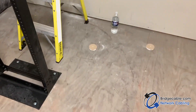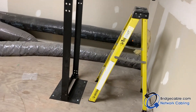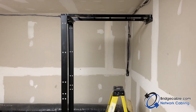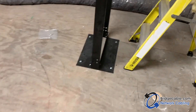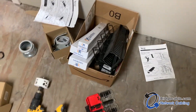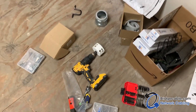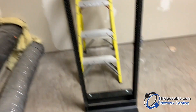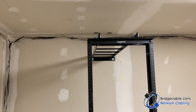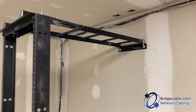He's about to cut some holes and put some conduit in there. You want to make sure you have at least three feet of clearance behind your equipment. We're just putting the bare bones in right now. Some of the things we're also going to do is cable management with D-rings. There's the conduit that's going to feed the main bundle, and a grounding wire somewhere. We'll come back in a little bit when this is all done.